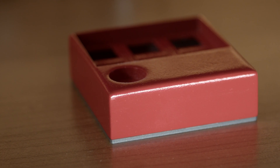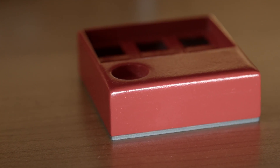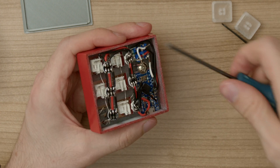This new case has a few improvements. First there's the hole for the rotary encoder, which supports the click and separate keybinds for both turn directions — that can also be switched for each layer. The bottom plate now has a lip on the lower part and a groove on the inside to click into the case, so no more need to get the press fit exactly right and also no screws for opening the case. The microcontroller can now be secured with an M4 screw, which makes everything a lot simpler to secure.